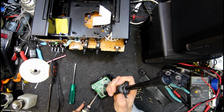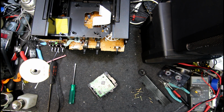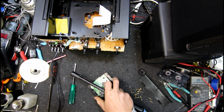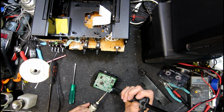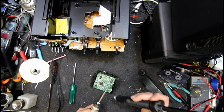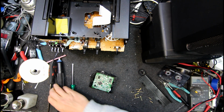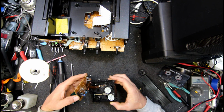Yeah, assuming that. I mean, normally if it's the motors or something, that's about the only thing you can get wrong, but if it's playing badly, it's often a faulty spin motor or something. But if it's not reading at all, it's usually the laser itself. Now, I don't know if these ones just fail suddenly or what, but they always seem to be in a non-read mode. They're not playing badly like a lot of CD players will get to the point where they play badly.